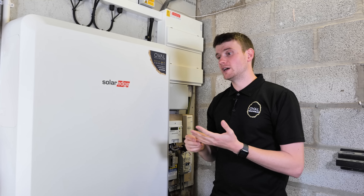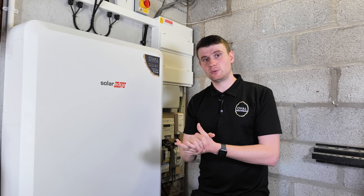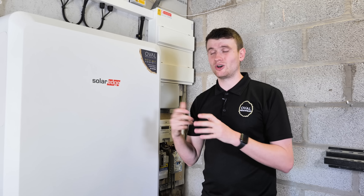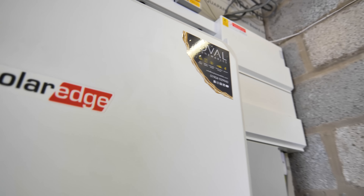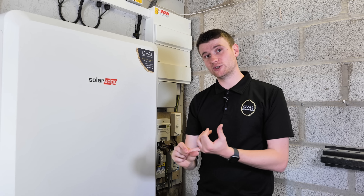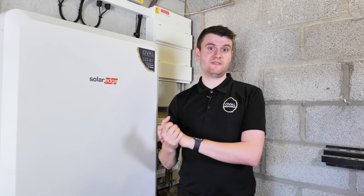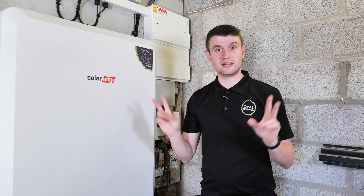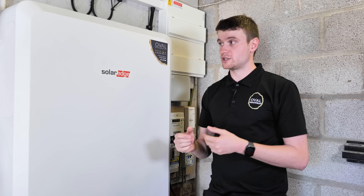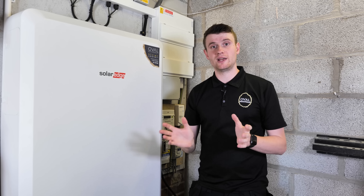Being real with you, we've had a few teething issues with the Energy Banks — a couple of issues with them dropping off the system where there's suddenly no Energy Bank on the monitoring dashboard. We've had one or two sites with a few issues; it's all been software related, not any physical hardware. Because it's a new product, as soon as you release it into the real world, little things crop up that weren't visible during initial lab testing. But SolarEdge have always been on hand to get it fixed, and we're in the process of doing firmware updates across a few sites.